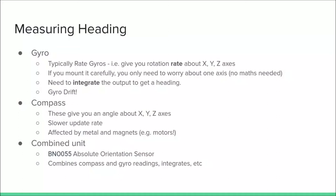A compass is a bit easier — it measures the Earth's magnetic field and gives you an absolute heading directly. But it has a slower update rate, meaning fewer readings per second, and of course it's affected by metal, magnets, and electrical currents, and every robot has at least two motors. The final option is a combined unit like the BNO-055, which has both compass and gyros, supposedly deals with all the hard stuff for you, and you simply read it over I²C and ask it where you're facing.